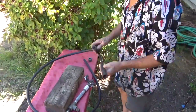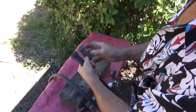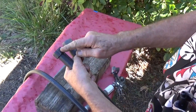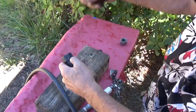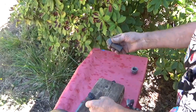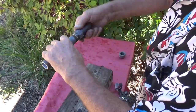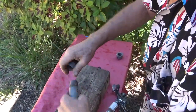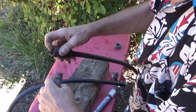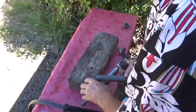The fittings at your home improvement store come in two varieties. The difference is the color — this is gray, this is black. The black one screws onto faucet threads. The gray one screws onto pipe thread, whereas the black one has different threads, it won't screw on worth a darn and it won't seal. So you use a gray one for your pipe thread.